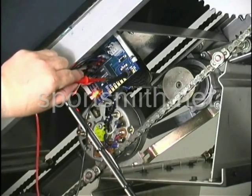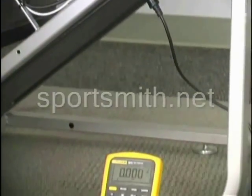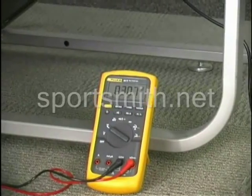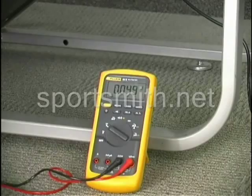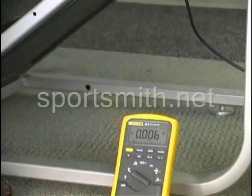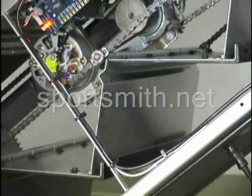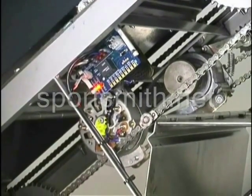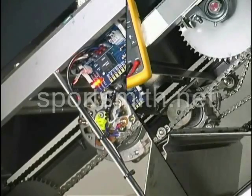I'm going to ask Tom to assist and we want to rotate the stairs. We've got volts on there, which tells you that's good — you're getting power across there. If the staircase is rotating and you're getting power across there, that's good. If you had received no power there, you would replace the alternator brushes inside the alternator if you received no voltage across those two test points.